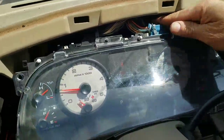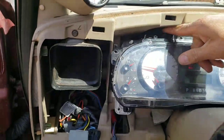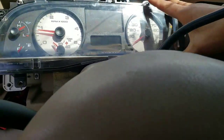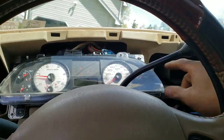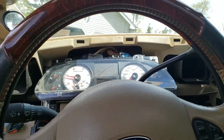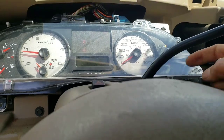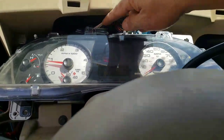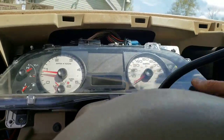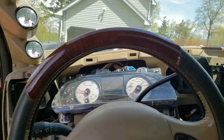Looks like it worked. Wiggling the plug — everything's fine. Hitting it, jumping around — everything's fine. Radio's staying on. I forgot I had to change the bulbs, so that's why I didn't put it all together. But that's how you fix it, boys. You don't have to take it all apart — take the glass off, pull that off. It's usually this plug. Put another zip tie on it, it's in there now. Bouncing it around, everything's staying on. Like and subscribe, boys.